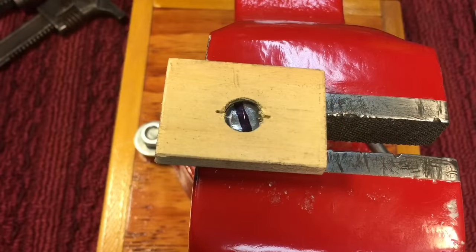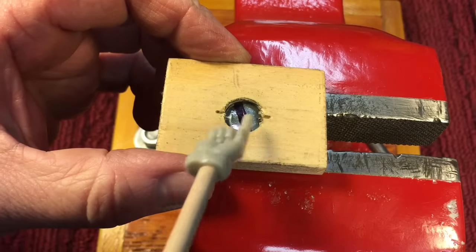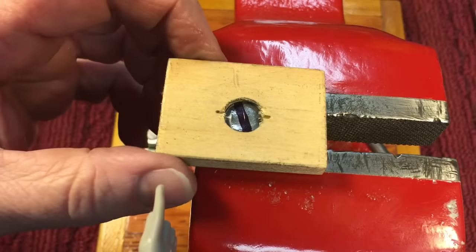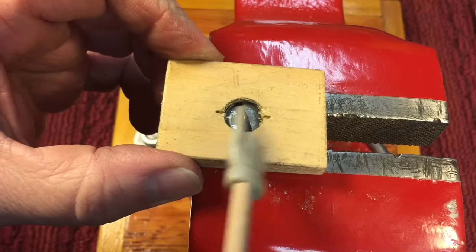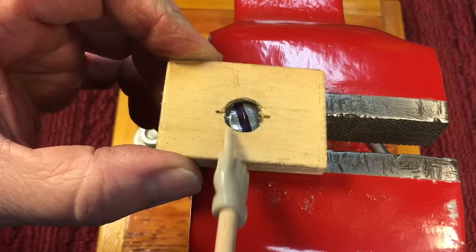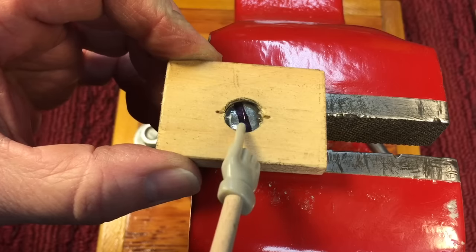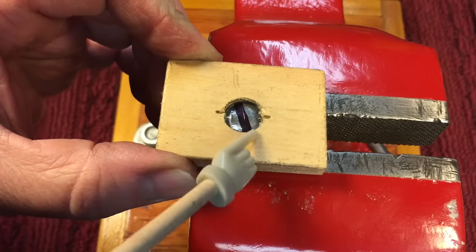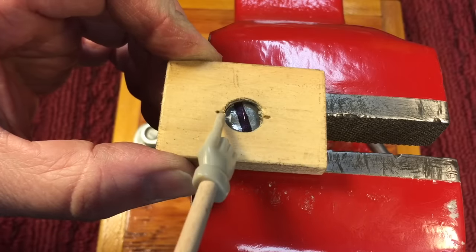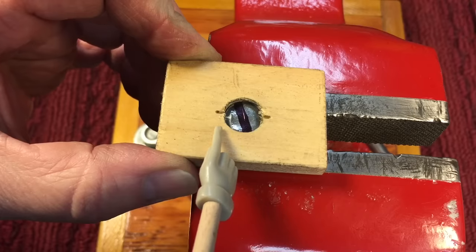Okay, here's a mock-up of exactly what's going on. The wood will represent the body of the wrench, and we have our screw in there. You can see it's been peened over here so that it can't back out, but you want it to release now because you've got to service the wrench. So the first thing you have to do is get rid of all this area that's peened over — you've got to unpeen it. How do we do that? There are a couple of different ways.